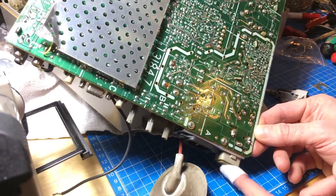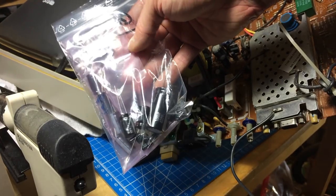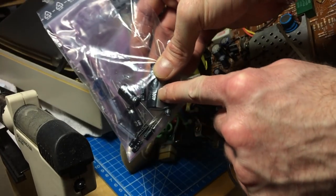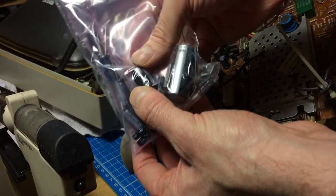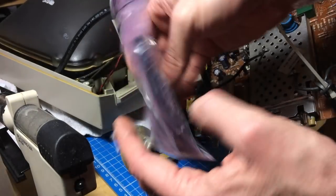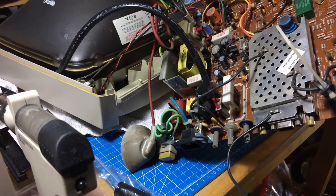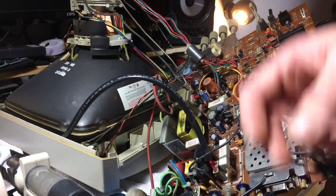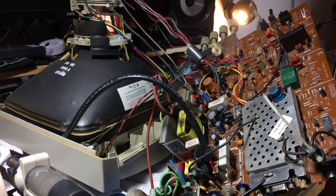The switch is back in operation. I've already bought an assortment of the less common capacitor values — for example there's a big 400V 100µF cap and some smaller 47µF ones at 200V. I hope to have most of the values. The bipolar cap will be difficult — I have some bipolar caps but they're a lot smaller and probably different characteristics. Now I'm going to start the recapping session, which I've done a lot in my computer videos.